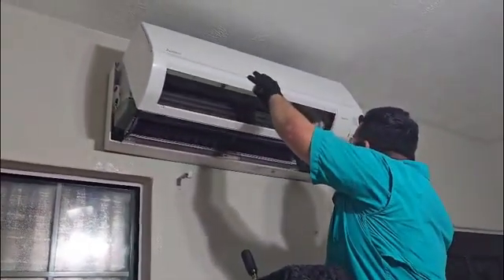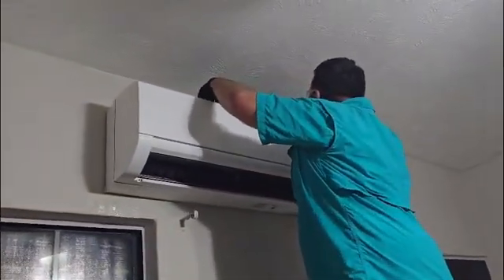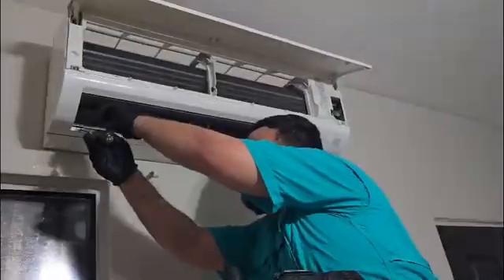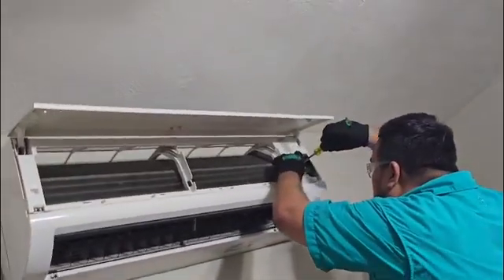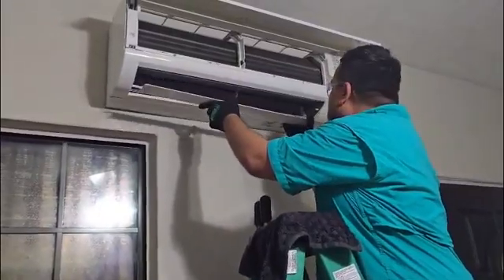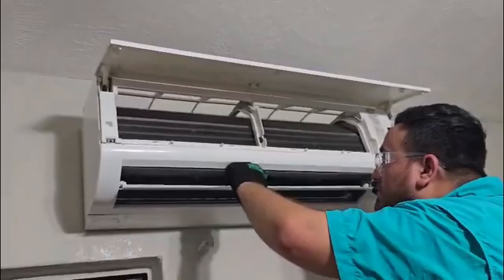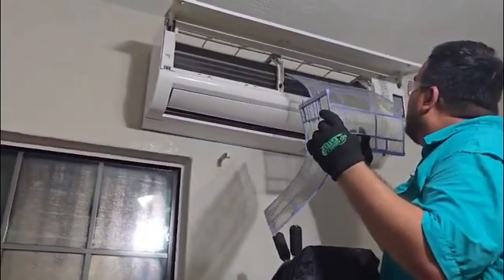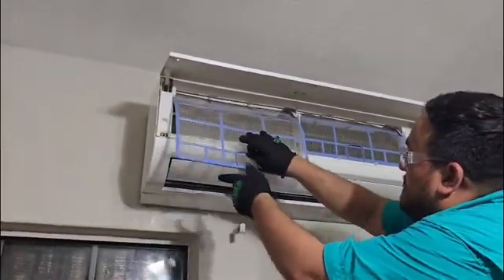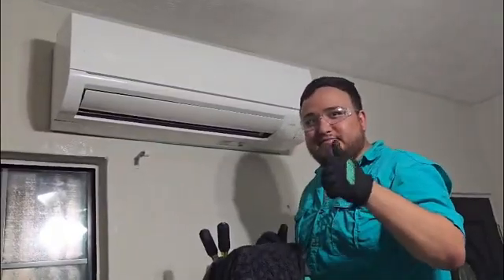Now we remove the tape and put the cover back on, snapping it on top as well. Then I open the cover once again and start putting the screws back — remember, there are three screws: one, two, and three. Then the cover for the electrical. And now we place back that air deflector on the mini split system. We finish off by putting back those air filters so we can catch as much dirt and debris through them first. And that's basically it, guys — that right there is a service and a cleaning for your mini split system.